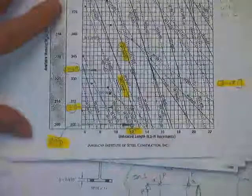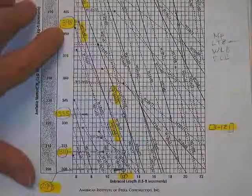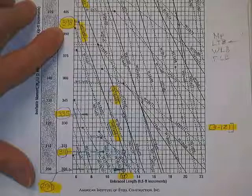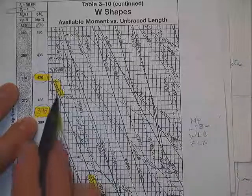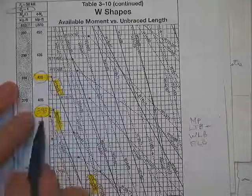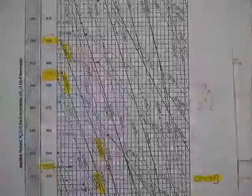You can follow the W21x48 up the chart to find its plastic moment, or you can get it from the Z-tables. The W21x48's plastic moment is 398 kip-feet — that includes phi. So we have: required is 406, available phi_b M_P is only 398. It's no good. The beam fails just shy of what we need due to the plastic moment limit. We have to move to the next trial.